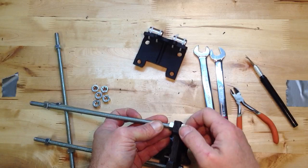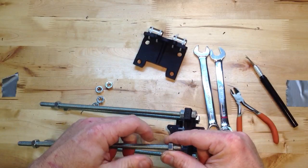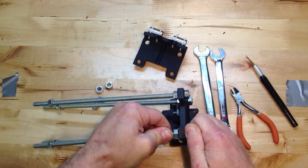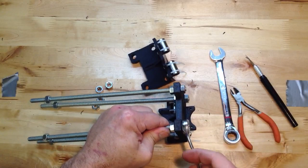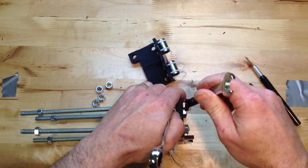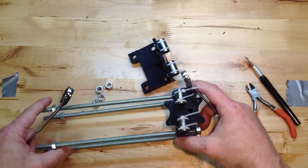The reason I put one side together first and then the other is I like to tighten down one side and make my adjustments on the other. I'll show you a couple tricks with the adjustments. It is very important that everything is level, parallel — very straight. You want everything nice and straight and plumb. Let's tighten those down a little bit. I'm not going crazy with these; I just want them tight enough where they're snug. If you start cranking on this plastic, you could crush it — not necessary right now to really get that down tight.